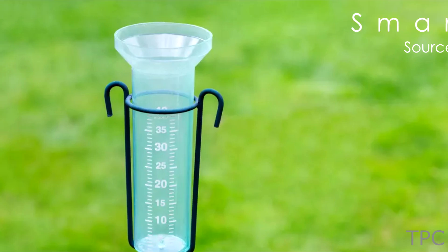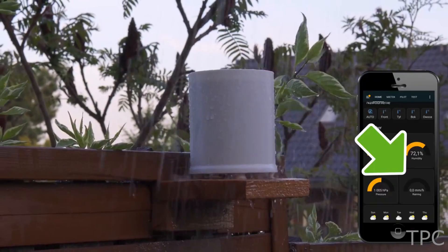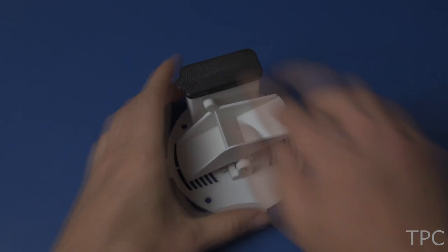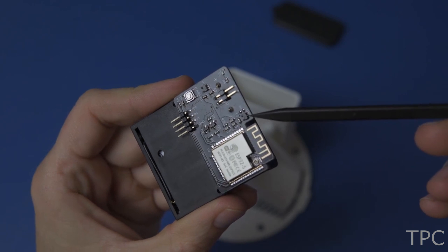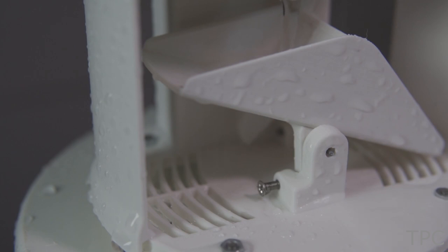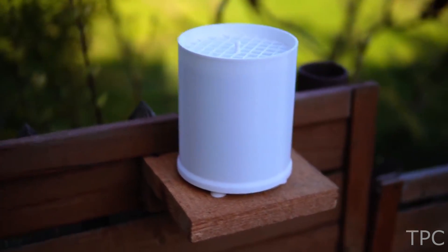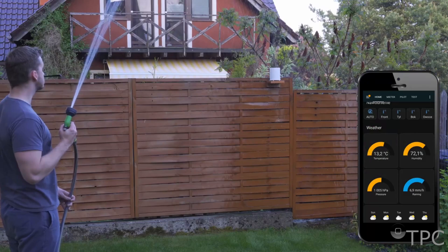Number 1. You might have seen various rain gauges, but this one's a bit different. It not only detects the rain, but also tells you how heavy the rainfall is. It contains a magnet at the top part of the tipping bucket. Inside this tightly sealed container, it has a PCB with a hall sensor. When the bucket swings, the magnetic field changes and a notification is sent to the microcontroller. The microcontroller measures how much time has passed since the last tick, converts it into appropriate units, and sends that info to the home assistant.